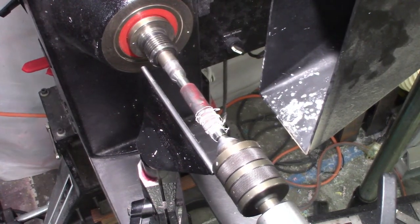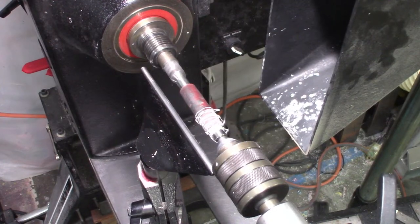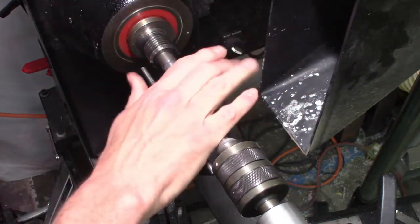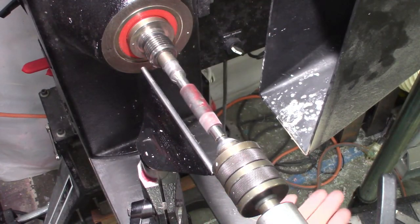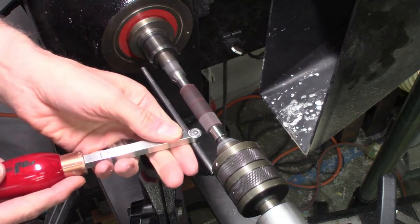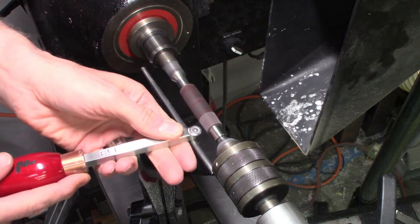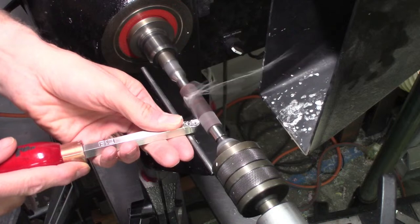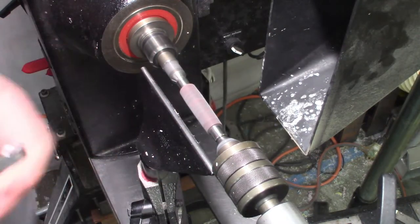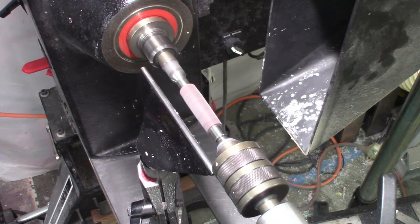I've been around woodworking for 15, 16 years, and dust collection's obviously a big deal, but I'd never even thought about the filters we use pulling dust up. If you're working on a lathe down here, or a table saw, the dust starts down there, and the filter, if you have it on, is pulling it into your face. So having something on the floor, you could even just put a box fan down on the floor with a filter on it, but having that downward flow is a slightly better way to do it. In some cases you maybe can't do it, but that's the other reason why I bought the Stratus air filter, because it's a floor-standing air filter rather than a hanging ceiling thing.